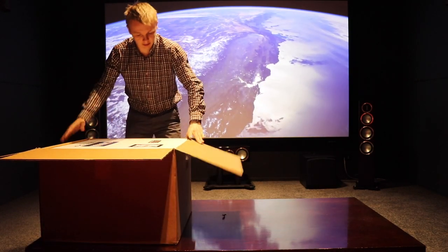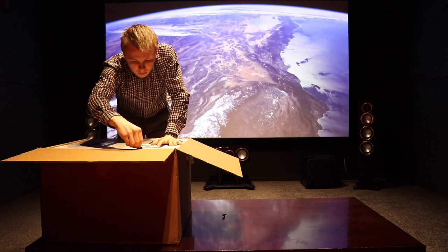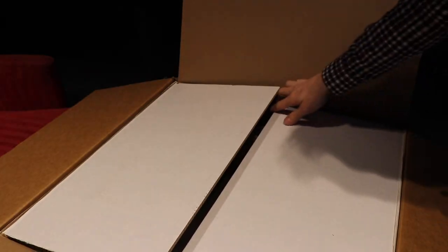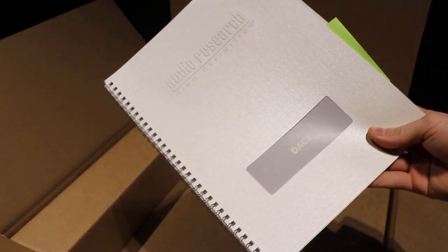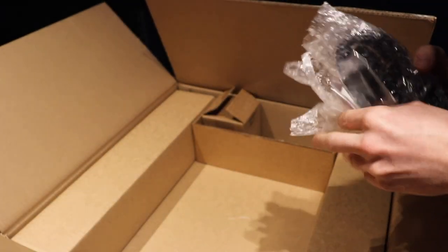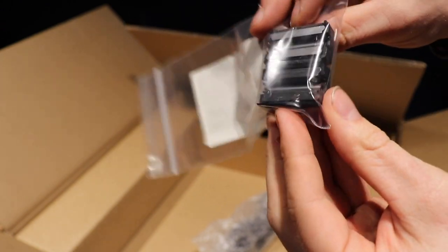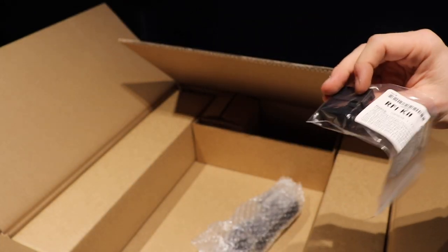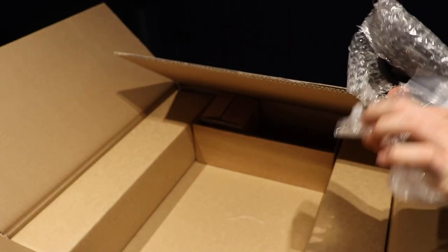White box inside the brown box. Caution: do not drop, fragile. So we have here extra covers for screws, our DAC9 manual and warranty information, an IEC 20 amp power cable, and it looks like they come with some snap-on ferrite cores — you can see how they're kind of those half-circle things. These snap on over the top of the power cable to reduce noise. It looks like they come with three of them, so if we want we can put all of those on.